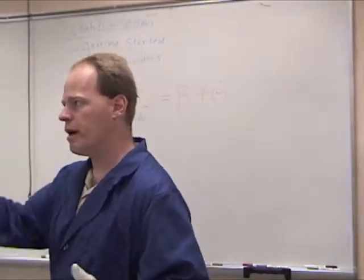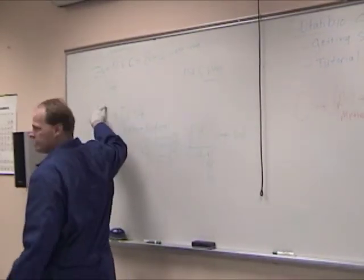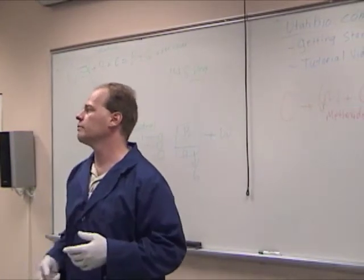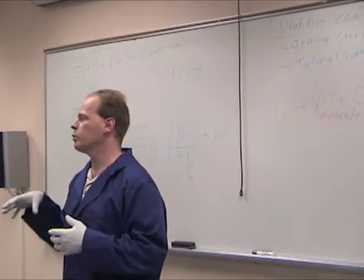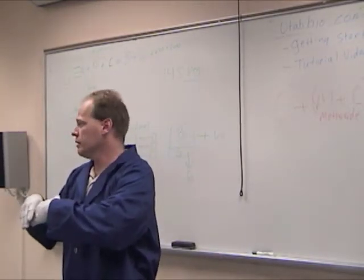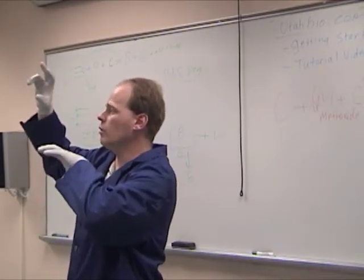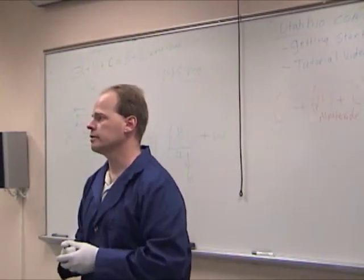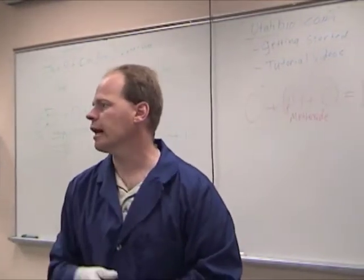The basic premise is you want the methoxide to mix thoroughly. You basically want the catalyst to hit all these molecules and really come together. Well, in a water heater, how most of them are doing it is you're just dumping it in the top. So you don't really get good mixing. To overcome that, we pour our methoxide in slowly and we pour it in right at the pump. That means we're going to get all the methanol touching all the oil. If you dump it in too quickly, methanol and oil don't like each other. The methanol will sit on top. It'll never mix with the oil down below. So you really won't get a good reaction. And that can be the same in all sorts of different reactors. So it's spinning. What does that mean? I've got just a spinner down on the bottom. I'm just spinning it for my mixing.